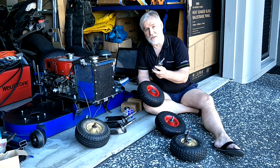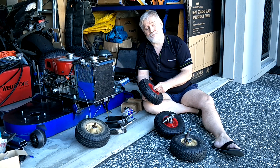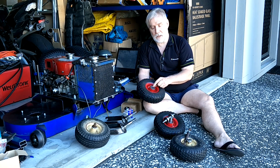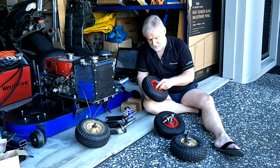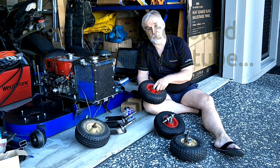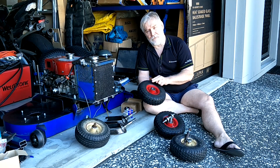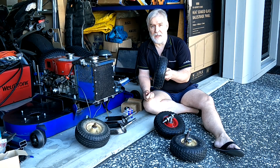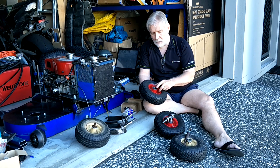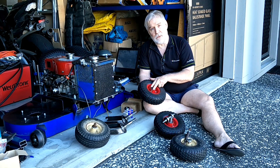I originally had asked Craig to make me some new axles to fit these new wheels, and as he was trying to press out these bearings he bent a rim. Now that's not his fault — that's just because these things are so ridiculously tight in what appears to be a flat piece of steel with a seam in it, making it basically impossible to push it out without damaging the wheel. These bearings should be a light interference fit; you shouldn't need to break the rim to get them out. Anyway, I'm going to try to repair these wheels.